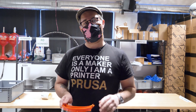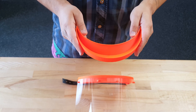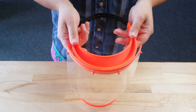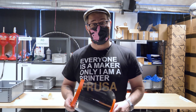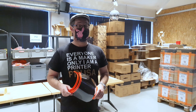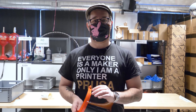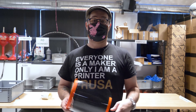Just recently we released the stack version, which allows you to print overnight without handling the printer every two pieces. We also provided a cap which you can add to increase the protection. It is also important that the cap for the top doesn't prevent the shield from bending, so it still sits great on the face. We also published a US version for a three-hole punch and for US materials, which is available online. We are still collecting feedback from around the globe on how we can make it work in all countries. We also had a couple of Czech test labs verify the proposed disinfection methods — they were done with live COVID — because everybody knows that 3D printed parts can be porous, so we wanted to make sure they really work. You can see the results in the link in the description.